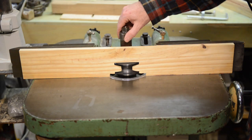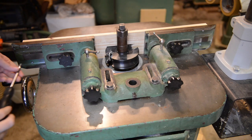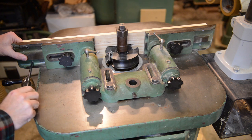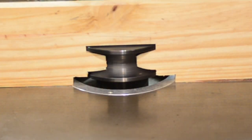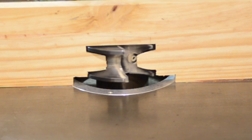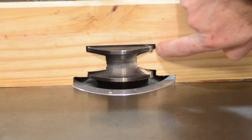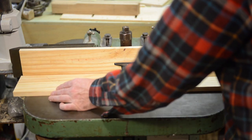Managing small parts on the shaper can be tricky. A false fence that attaches to the main fence through the back with screws will essentially make you a zero-clearance fence, pretty similar to a zero-clearance insert on a table saw. This closes up any unnecessary fence openings that the stock might want to dive into, and it also helps with cut quality and dust collection. Pushing the fence back out a thirty-second of an inch will reduce noise, limit heat buildup in the cutters, and improve airflow for better dust collection.